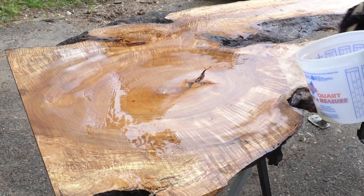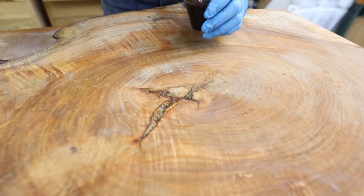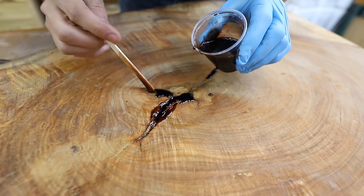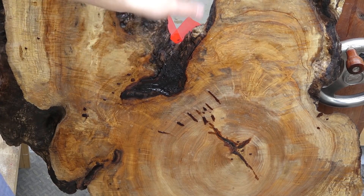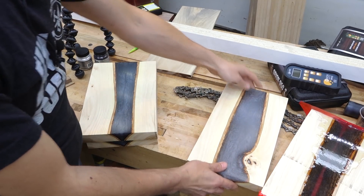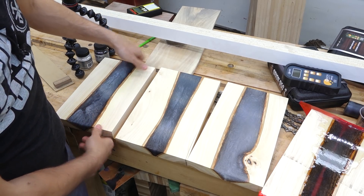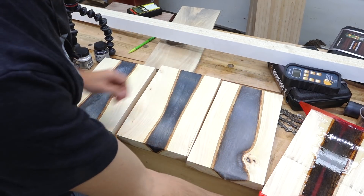What's really cool about covering the whole thing in penetrating epoxy is it's like putting on a first coat of finish — you get to see all of the crazy figure and grain in the wood, and this piece is going to have some pretty incredible figure. Right now I'm working through getting all of the surface imperfections filled with brown tinted epoxy, which gives a nice little shadow line. On the last shop update I had these rough sample pours to get an idea of what the different pigments would look like. These are all cleaned up now, sanded, and have one coat of finish on them — though things are still a little too dark and opaque for me, so I poured another sample.